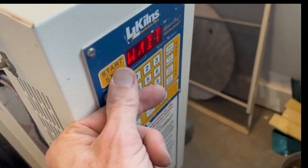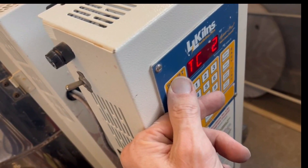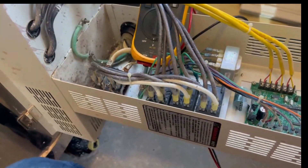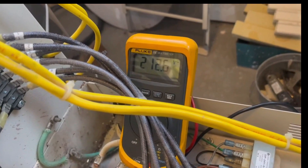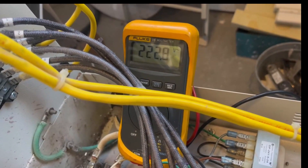I'm just going to turn it on to something — it doesn't matter what it's on. Okay, so now it's on. The first thing I'm going to do is touch these front two terminals. We get 220 — it's not getting a perfect connection, but you can see 215, 212, and that's just off the front two terminals. It should absolutely be 220 there. If you're getting something crazy, you probably don't have a good connection on those front two terminals.